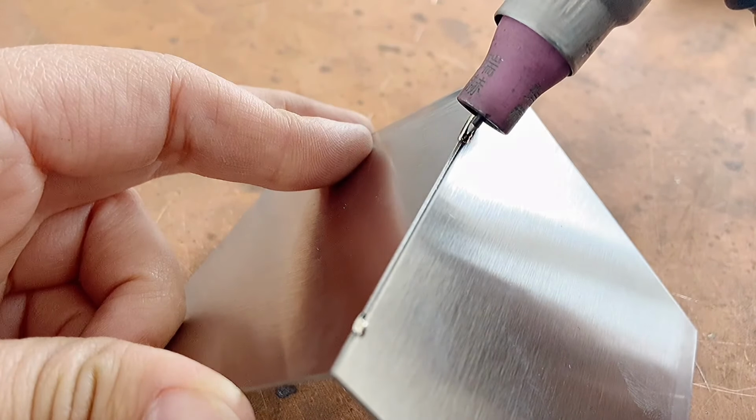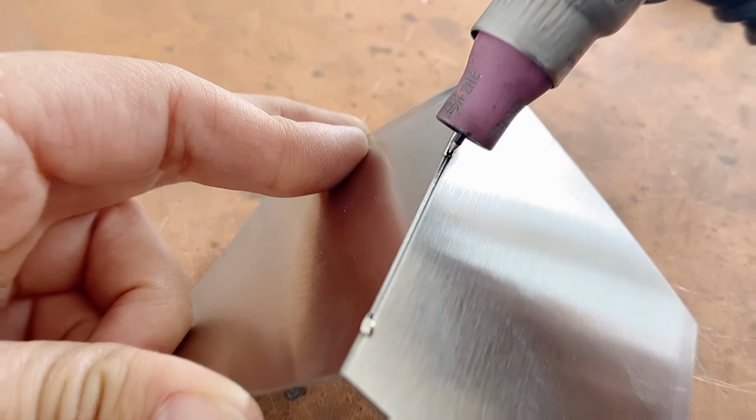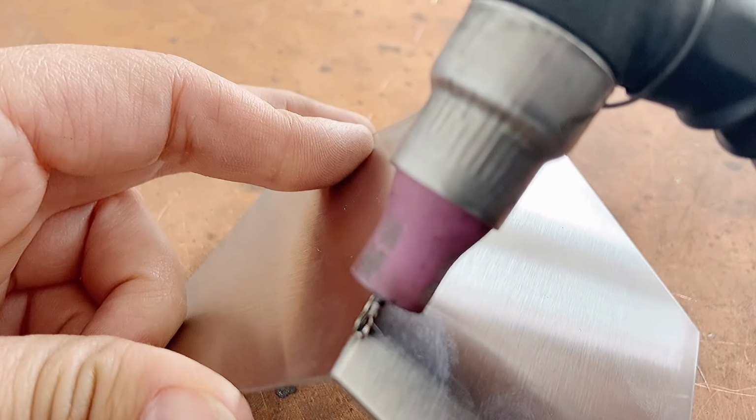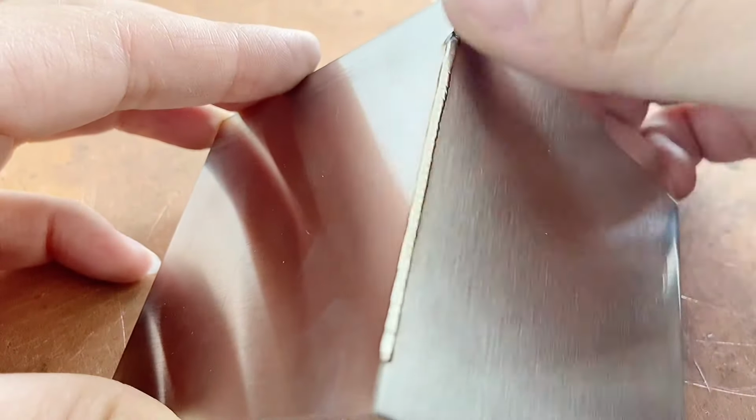Now the demonstration is the spot welding mode, that is, press the switch, and once the arc starts, a welding spot will be formed. As long as we keep each welding spot moving evenly, a relatively uniform fish scale pattern will be welded. The final effect after welding is a silvery white fish scale pattern, which avoids the later grinding and polishing, and does not damage the wire drawing surface. The solder joints can be directly touched by hand without deformation.